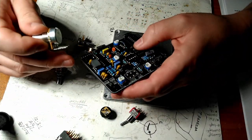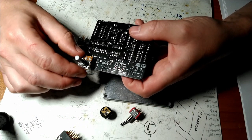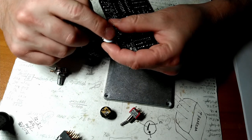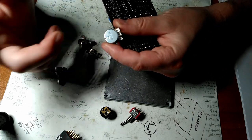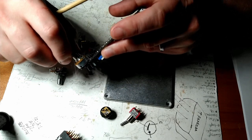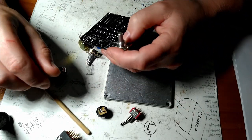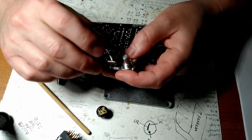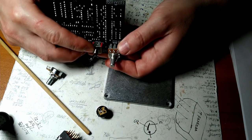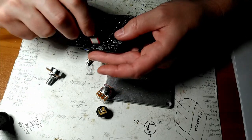You'll see that all these board manufacturers make their boards for this kind, where they mount directly to the board, like so, which is absolutely fine. I recommend you put a piece of electrical tape, or like the new Gorba switches have a little piece of plastic here, so that you're not shorting out all the components underneath it if it touches. But just be mindful that when you drill out the holes on your enclosure, you better be spot on to make this thing all fit and work. The switch and the pot may not be exactly the same height, but there's some travel. It's just black belt pedal making stuff, and I'm a pink belt, so here we are.